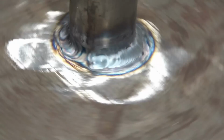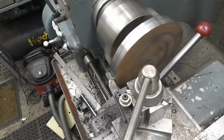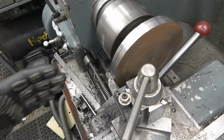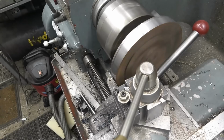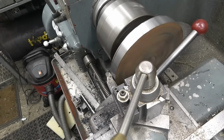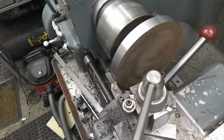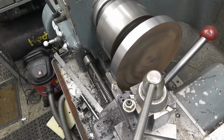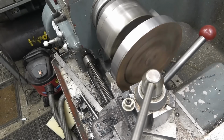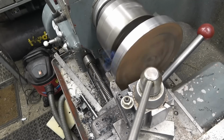I don't think it'll fall off. There's quite a bit to come off it, roughly into the side and that front face once machined as well, because it's a little bit pitted, but the back face is pretty good. We'll get it down to 6 inches first and then face it, then turn it round, chop the stub off it or weld it on, machine that face and then drill the 30mm hole.